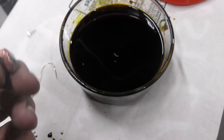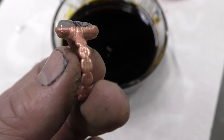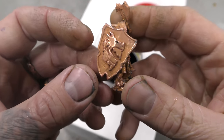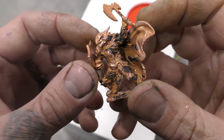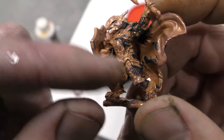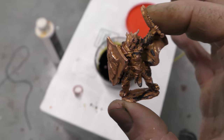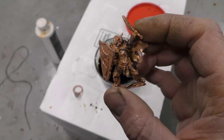I have another test piece I'll pull out in a few minutes. This one was only in there for about 10 minutes and you can see the copper plating wasn't thick enough — it just totally ate it away. But where it was thick, it's pretty shiny. So if you have something with very thin layers of copper, this is probably not a good method unless you're really quick — maybe three minutes.